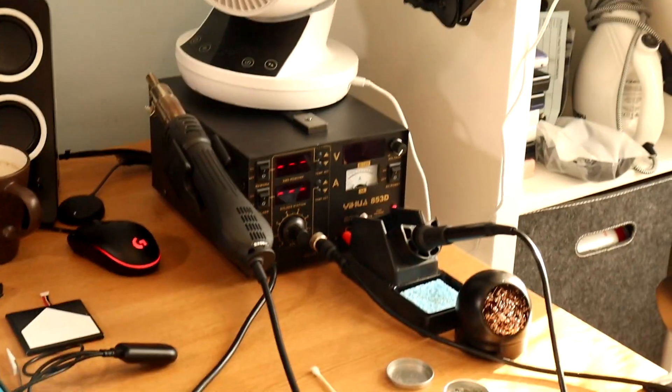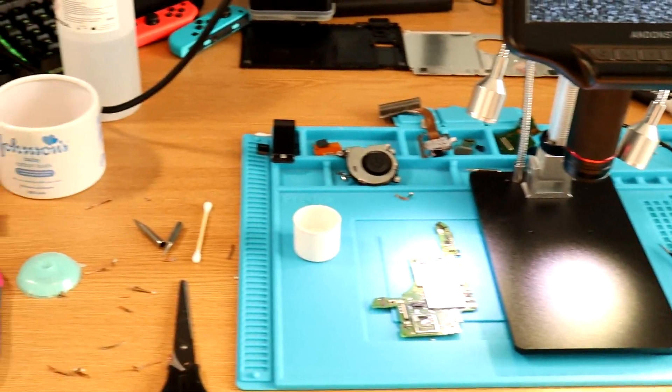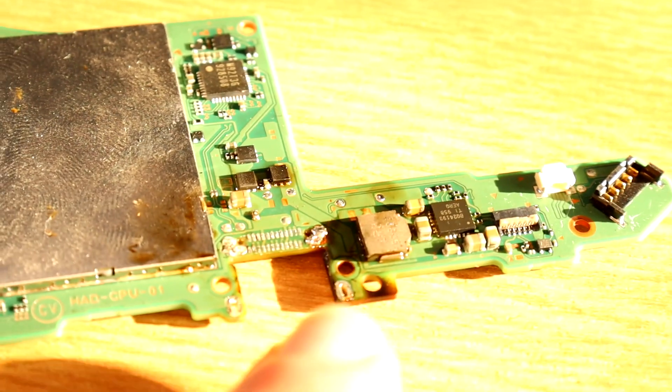I'm angry and disappointed. I'm very sweaty, very hot, very agitated — I need to reset and recalibrate. This is where I'm currently at after non-stop use of the soldering station with the fan on — it's just an absolute mess. Look at all the wick. The board itself is completely gone, it's so burnt. I've messed this up so bad. The wick just kept falling apart and I literally used the whole roll. I must have had about seven attempts on the good Nintendo Switch — both with hot air and iron — and just couldn't do it. I started with five ports, used one on the old board, and I've got one left, so I've used three ports trying to get this to work.